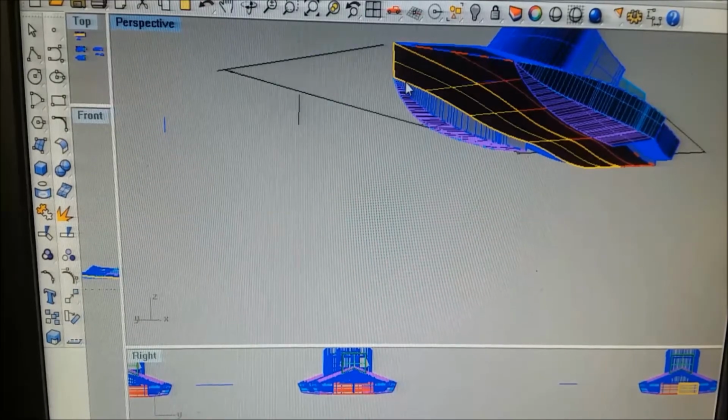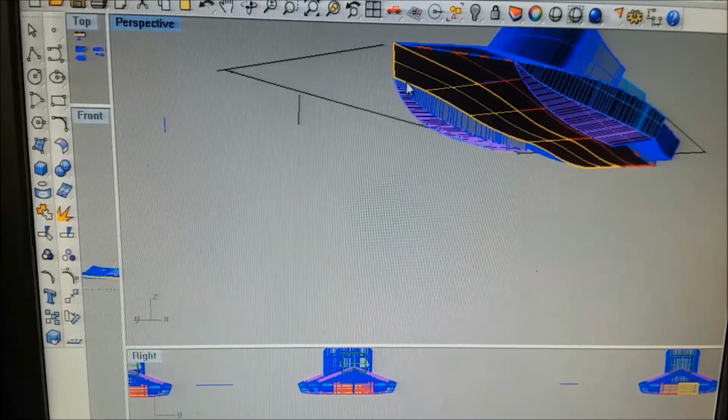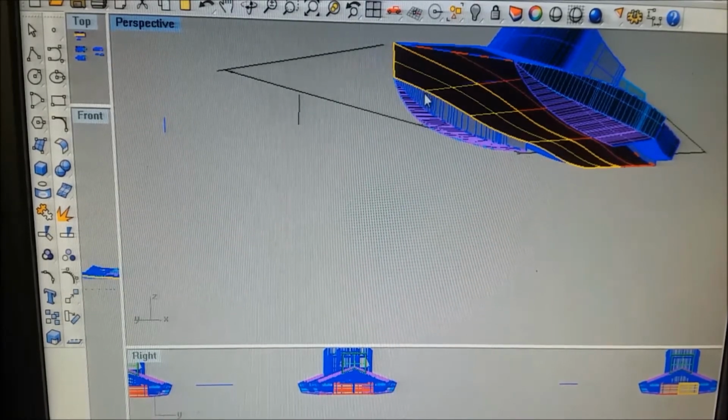and you get a pretty good tack, and then you go back in front of that tack and weld about 1 inch. After that, you take the flat side of a 2-pound ball peen hammer and hit this surface flat and that surface flat. That'll suck that edge together. Then you move towards about 1/8 inch apart, put your 1/2 inch tack, and while it's still red, you smack it with a hammer in the two directions, and that'll suck that together.